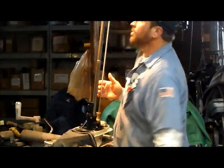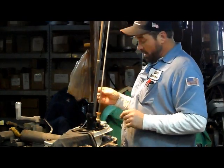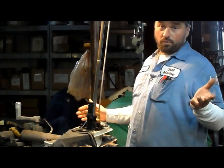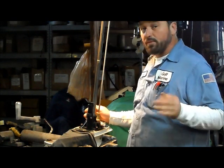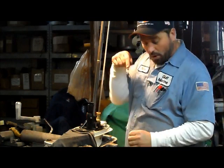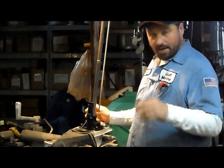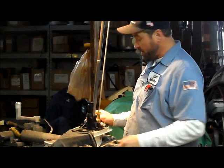You can do it in forward or in reverse — just make sure you do it the same way twice. Make sure your shift rod does not change in adjustment, because the adjustment on the shift rod is turning it in or turning it out. If for some reason it does get screwed up, one of our rule of thumbs is: if you screw it all the way in, back it out six turns — five and a half to six turns — it usually ends up right. But you may end up having to drop the gear case and do some adjustment on it if you're not getting the proper shift relayed from your control to your gear case.